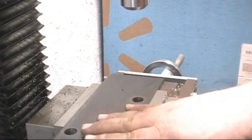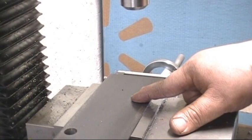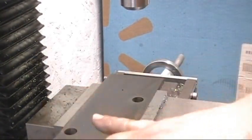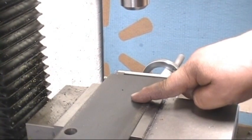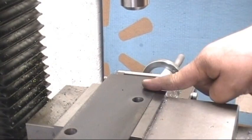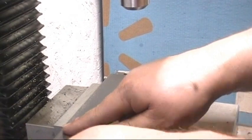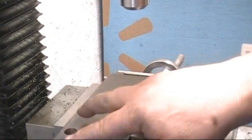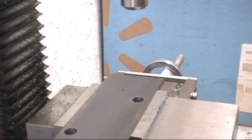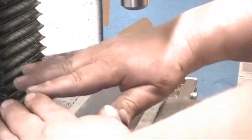Well, we got the remodel plate done. There'll be four of the cultivator spring plows, one in each hole here. But where these were normally here, we're going to leave these. Well, they were actually out here, I think. We're moving two in and two in the middle. We're putting four in the middle where there were two in a wide gap. We're trying to kind of close this gap in because they're going to cover a 2-inch spot apiece. There'll be a little bit of dirt gets through, but I'll probably turn this one slightly and this one slightly, so it'll be almost pointed.